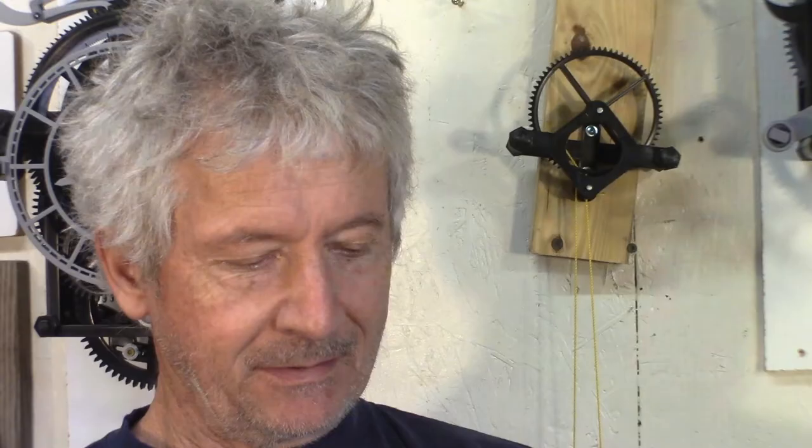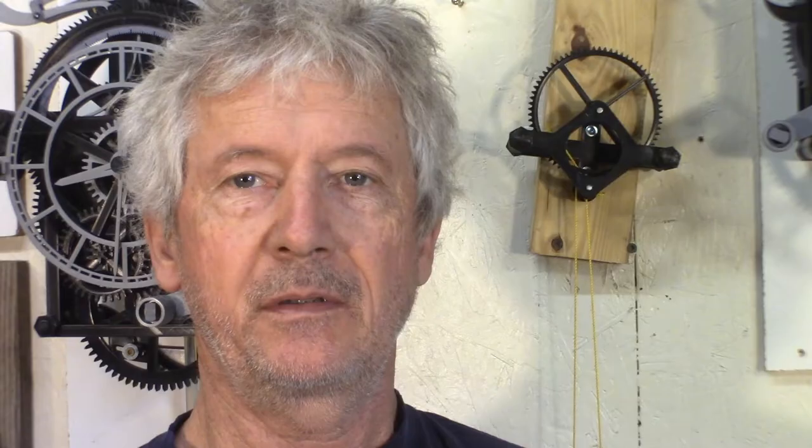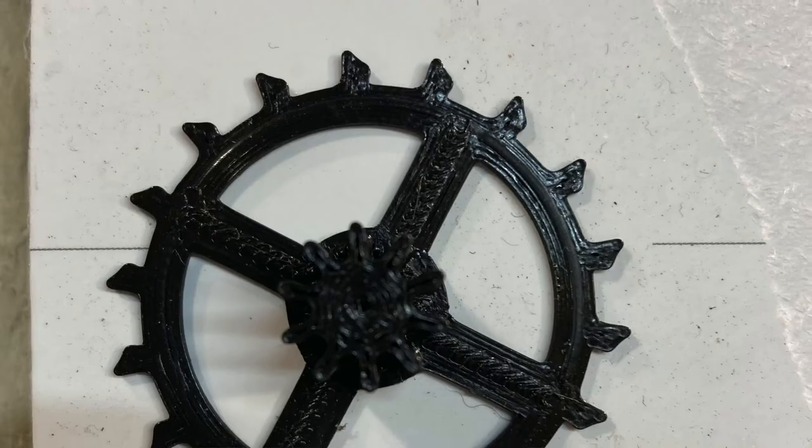First, there's a lot of bulging at the end of the teeth, and those teeth are not involute — they are triangle. You can also see the bulging on the escape wheel. It should be sharp angles like this, but the impulse face has that curve because both ends are bulging out.